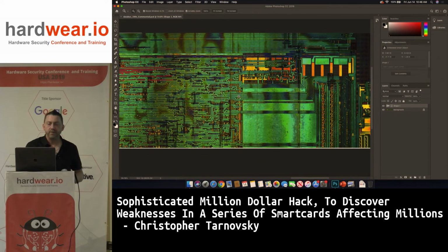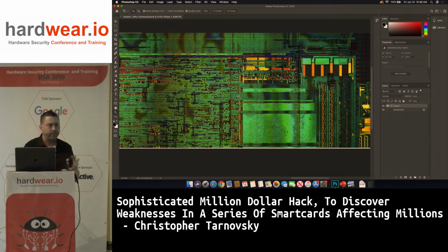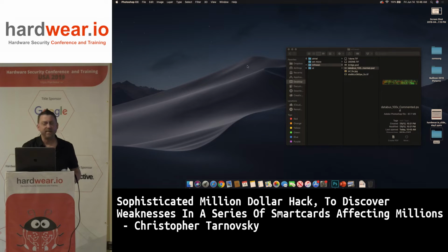So you can see here, this is one table of the microcode. So basically the instruction register was here, and it points into this table, and it gives an address to another microcode table of where to begin running from. Go to address, an add is at microcode line 10. A subtract is microcode line 20. Stuff like this. The 66 I think it's dead today.